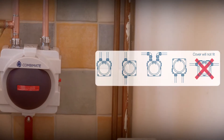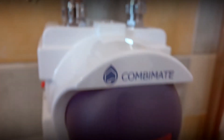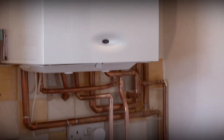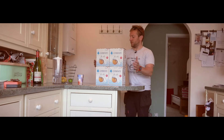Note the many different combinations in which the CombiMate can be fitted. In order to keep the filler plug upright it may be necessary to rotate the dome relative to the base and relocate the divider tray. We've got our CombiMate installed, we've got the water back on, we've tested for leaks — that's all fine — and now we know that the hot water side of this system is protected by a CombiMate. That means we're not going to get any problems with the plate heat exchanger on this boiler anymore, and the internal components on the hot water side will also be protected from scale. Everything's done now — I'm just going to put these in the van. Remember to hold tight. See you later!